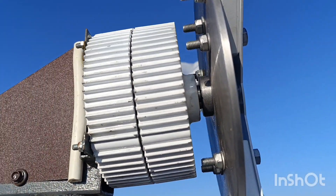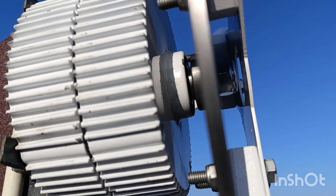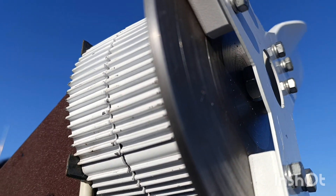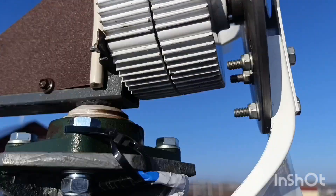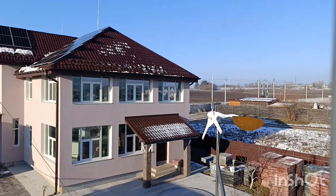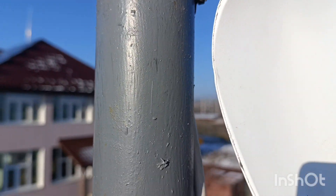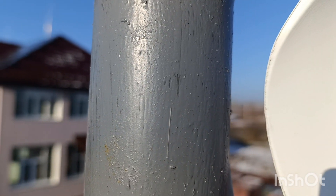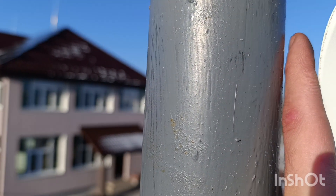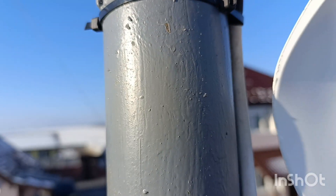It is mounted. Here is the press washer on the left side, and on the right there is an additional locking nut. That's the best thing I could think of to lock this and make it not come out during rotation, because the rotation is counterclockwise on this one — on the bigger ones behind me it's clockwise, and here it is counterclockwise. The thing I was also worried about is how little space there is here — maybe 13–14 millimeters — and because I have the cable here, it's even tighter.